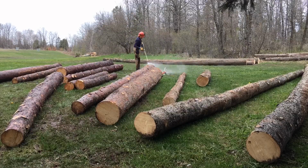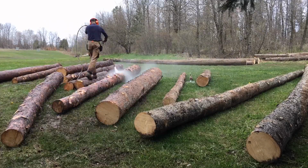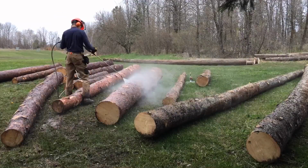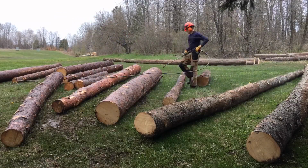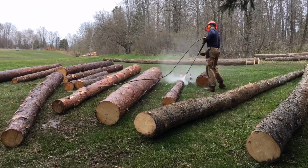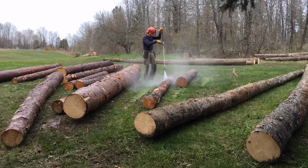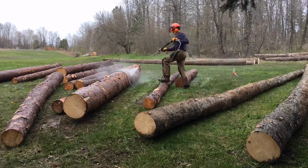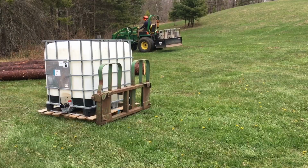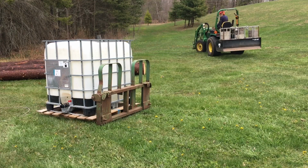I also got 9 cedars down. I wanted to do more of the cabin out of cedar, but the bottom 10 feet of most cedars are rotting in the middle, and the trees tend to taper so quickly that it was hard getting longer lengths of usable beams. I was hoping to use them for the walls, since they're going to be vertical, and I only needed 9 footers or so to pull off wall beams, but I only got 9 cedars in the end. So I was hoping to do more because cedar's lighter to work with. Would have been easier for handling.